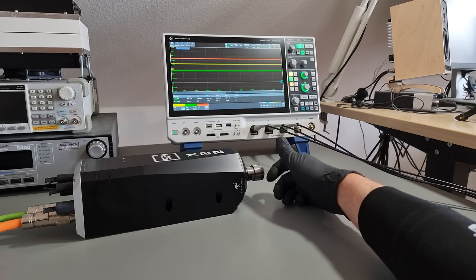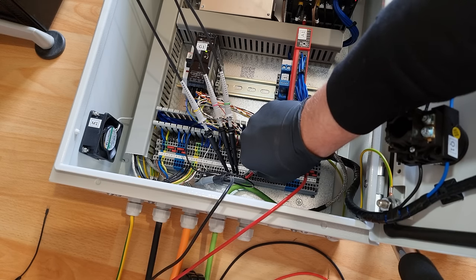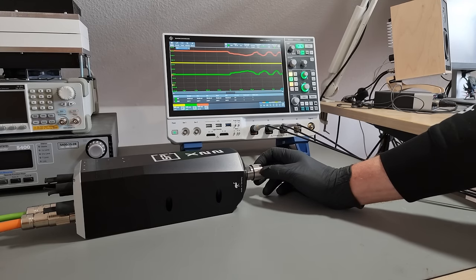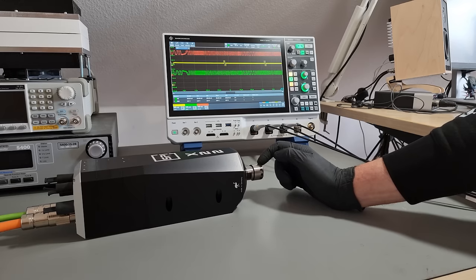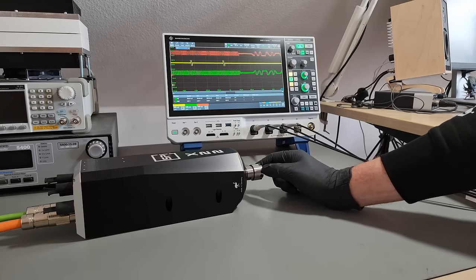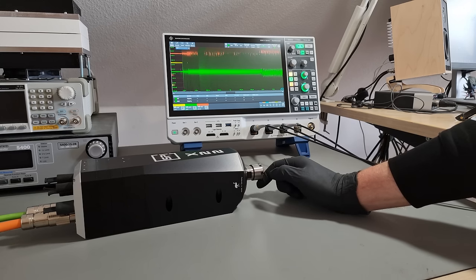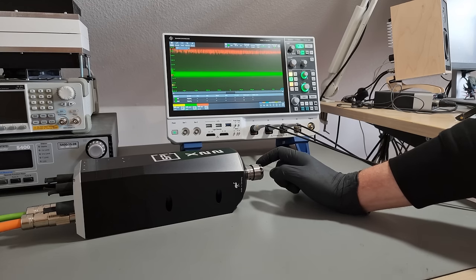We're not getting much out of the as-yet unused encoder outputs, because we are still stuck with a preliminary control cabinet that isn't meant to take full advantage of positioning control. For one, we have to feed the encoder with five volts, which this box isn't prepared for. The encoder outputs are sine-cosine — advanced difficulty. This is usually a higher quality encoder interface than the more common digital pulses-per-revolution type, because a controller can digitize and interpolate over these analog waveforms with very high resolution. Not all variable frequency drives support sine-cosine encoders. When the VFD is turned on, it pollutes the encoder outputs heavily — that's why they are brought out as differential signals, which can be converted into usable low-noise single-ended signals just before reaching their destinations.